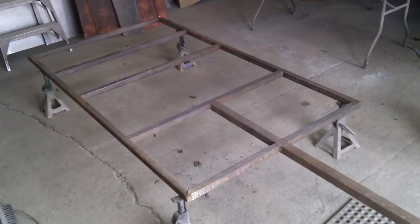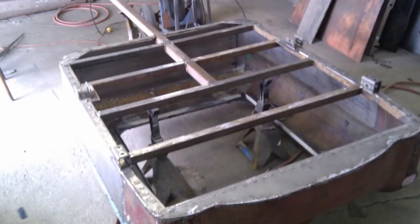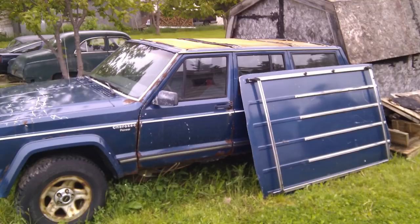Now it's time to move on to the frame. I had an old teardrop project frame that I had built but never got around to using. I took that and used it when I first started building this trailer — it was 4 feet wide, and that's why I built the trailer as wide as I did. All I went and did was shorten it up so it fit down inside the body of the trailer, then capped off the ends, with the front corners turned with little sections of steel welded on.